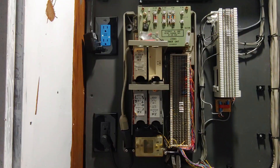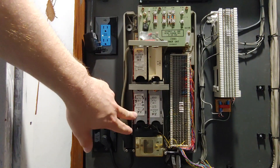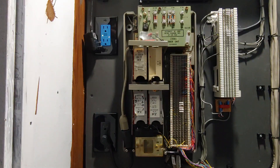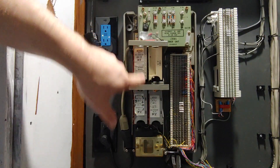This is the key service unit for the system — a model 551c, also known as the shoe box due to its size and shape being about the same as a shoe box. Here are the line cards: three of these are original — well, two are original, this one was replaced in the seventies, and this one is a replacement from another manufacturer that makes a similar product. They're all electrically compatible, which is rather convenient.